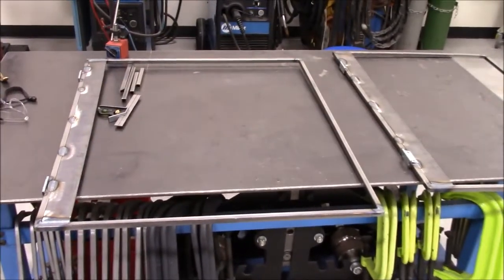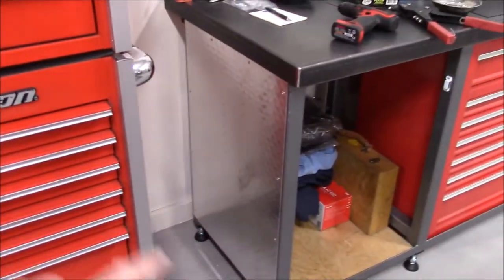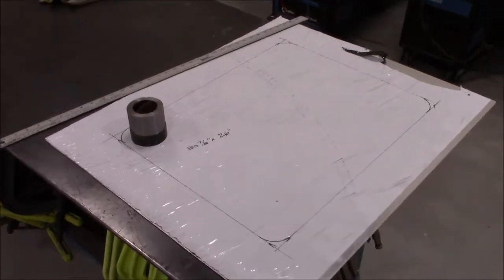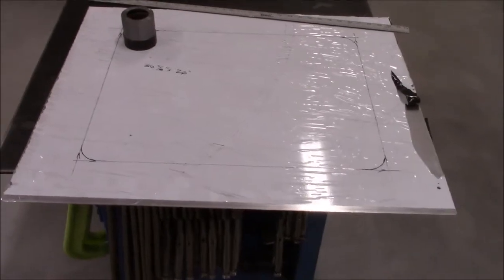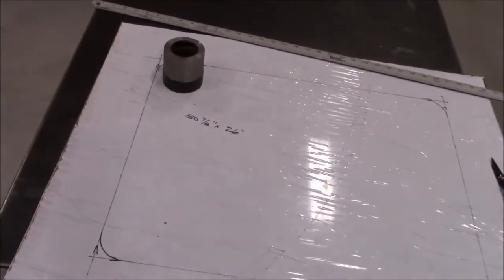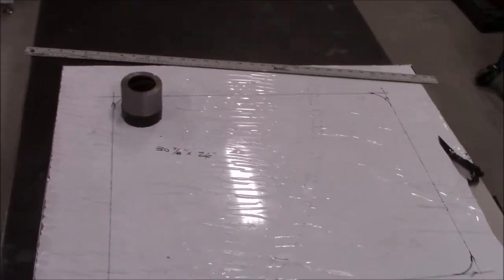One panel cut — I got the side panel here cut and pop riveted on. Now I'll move into the two doors. I'm really pinched for time, so I've got to get a little creative on this. I came in four inches all the way around the perimeter and found about a two-and-a-half inch diameter to put a radius on the corners.